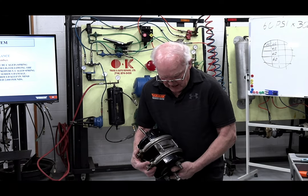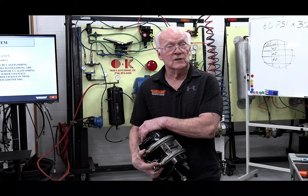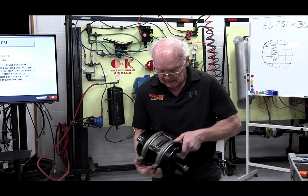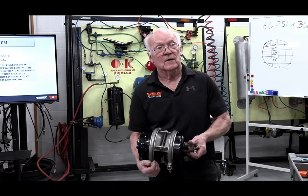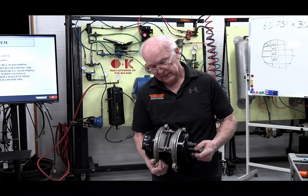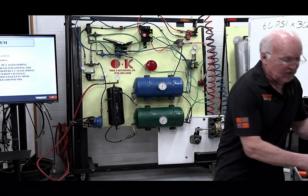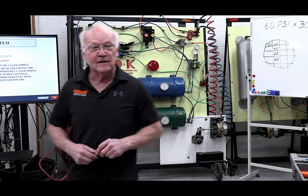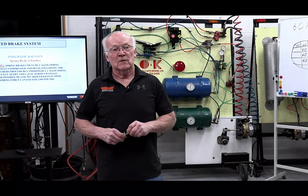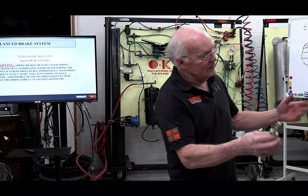Now, I have this caging bolt here. Do you want me to tell you the truth? When I change a chamber, I'm going to keep this bolt. I can't leave it on. Some of these have that aluminum tube, so by the time somebody needs to use these, you'll never get them out anyway. And again, in the books, it's not the way it's supposed to be. But chances are pretty good today, if I go on a service call, or even in the shop, and you guys will probably verify it, you need to get something in, the brakes have locked up, you can't start the engine, whatever the case may be, I'm going in my toolbox and I hope I have enough of these. I know somebody would say, oh gee, you're not leaving it in there.